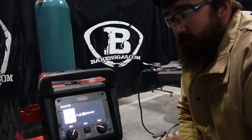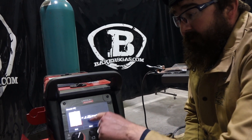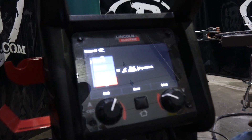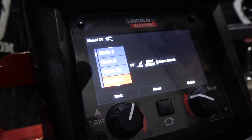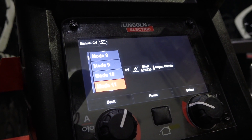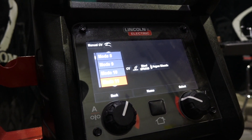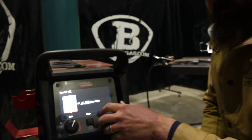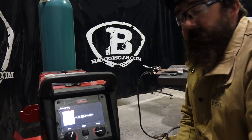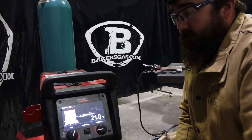So let's just say Mode 11. I remember using Mode 11 a lot on the 350 MP. That was 035 steel, argon blends, straight CV — Mode 11. This unit not only has the ArcFX and the Synergic MIG settings, but you can also just go back to the old style where you used to have to toggle through. Now it's all on a digital screen. Pick Mode 11 or Mode 5, whatever you used to have on your 350 MP — it's now available on the 360 MP. It's just in this screen. So let's go home here.